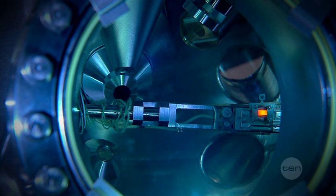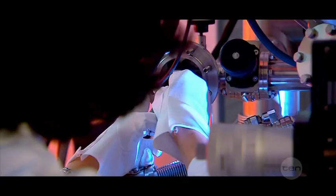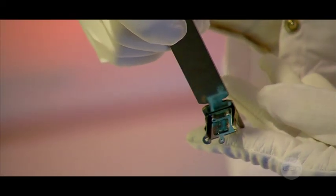With silicon, for example, we need to heat our sample to 1200 degrees Celsius to clean the silicon surface of all the other atoms. And this preparation needs to be done in an ultra-high vacuum environment — an environment where we take away all gases, even air. This is because atoms in the air can attach to the sample and can affect the images while the microscope is scanning.